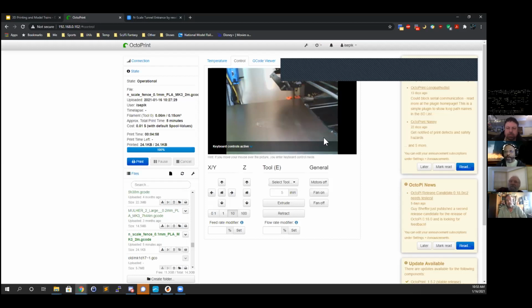On a double hung window, I've done this enough that I wouldn't print the window up vertical. I wouldn't print it sideways like that. I would print it on its side on the edge, because then you'd most likely have all the support you need. And I could also print it with supports and tell the software, don't attach the supports inside the window, attach it to the bed. That way it minimizes the number of possible burr points on your finished print that you have to sand out.